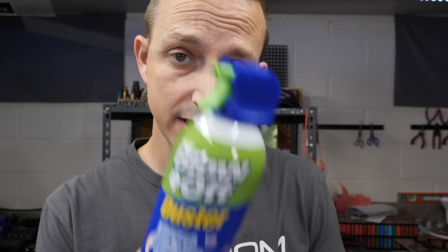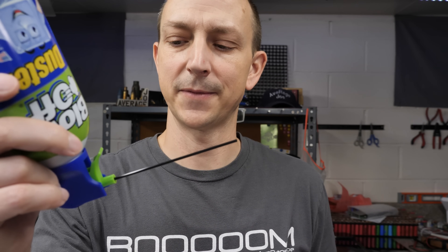A side note: the low-temperature cutoff sensor is only about this long and it's underneath the circuit board. I can't put it in ice-cold water like everybody else does, so I'm gonna have to improvise. I'm going to be using this air-in-a-can. The trick is if you hold it upside down it sprays out something — probably something harmful — but it gets really cold. We'll spray that right on the temperature sensor and see if the low-temperature cutoff works.